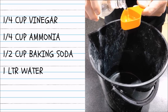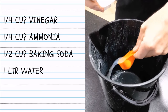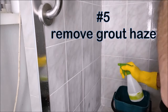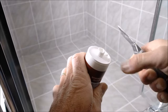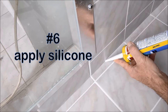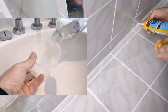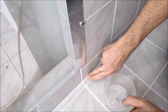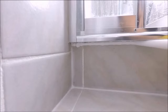Here's my recipe for removing grout haze — if you're going to take any tip from this video, this would be the one. Make this recipe using things you've probably got in your cupboard at home. Spray it onto the tiles and wipe off the grout haze. Next job is to replace the silicone. Push the silicone into the gap ahead of the nozzle — I used an Acetoxycure silicone which smells a little like vinegar while curing but it's better for wet areas like bathtubs and showers. With a soapy water mix, dip your finger and smooth out the silicone, wiping excess on a paper towel. Your finger puts the perfect radius on the silicone.